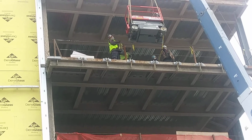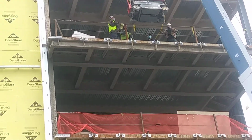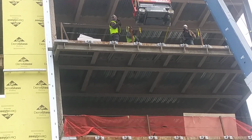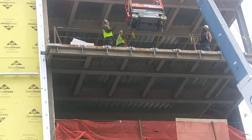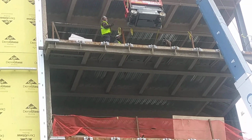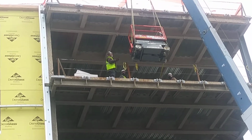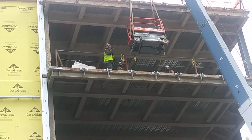Like I said, a come along makes that so much easier. Even one come along with two guy straps makes that so much easier. The come along will pull that in so easy. You'd be surprised, a couple of ratchets of the come along, that thing pulls in. Once it passes the rope, the crane operator drops it and you're good to go. That's probably the easiest way of doing it without hurting yourself.